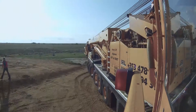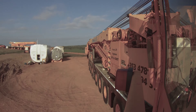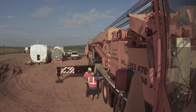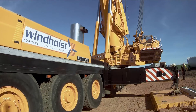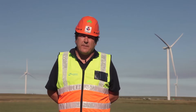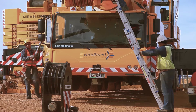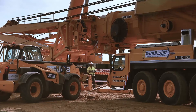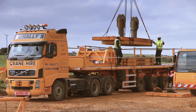The first step in the process of installing the turbines is to get our cranes into position. We start by choosing the correct crane pad, which we liaise with Nordex on, the sequence of turbines they want to put up first, and then we pick the safest, quickest route for rigging the cranes. We position our cranes as per our drawings from our technical team. If the weather is with us and conditions are right, four hours to rig the cranes.